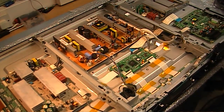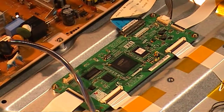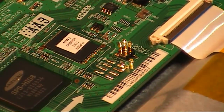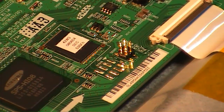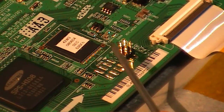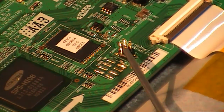We now have access to the control board which is here. On the control board you have these 4 pins, and by shorting out 2 pins — these 2 pins here, connect them together — you could get a jumper lead and do it, but I have just got a screwdriver here.